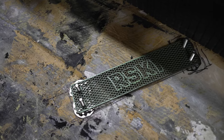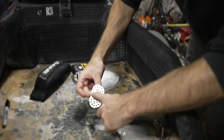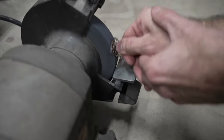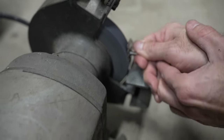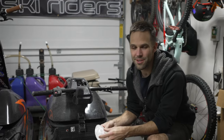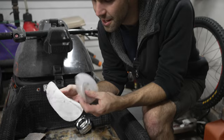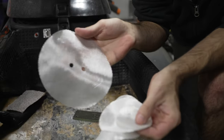Now that we've got everything located and marked, we take these stainless steel inserts and grind the bottom of them with a really rough grinding wheel to make sure they have a good grip when the epoxy dries. The next step is to dry fit your fiberglass pieces — these are laser cut with the holes in them, everything really nice.